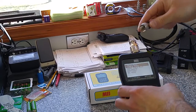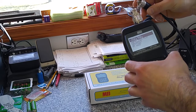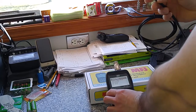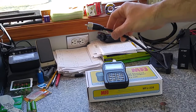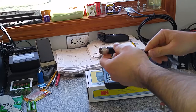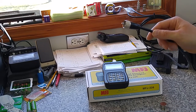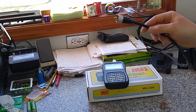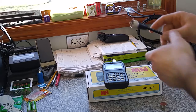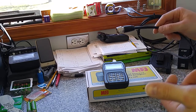Let's see what this thing can do. We got this hooked up right now to a Diamond X300A — it's UHF to UHF, SO-239s on both ends of this cable. I plan on actually replacing this cable all the way out to the little tower that I got. This stuff right here is Radio Shack RG-8X, and then all I was able to get a couple years ago was some RG-58 coax. This stuff is definitely old. The loss on it, especially once it leaves the 8X — which is only right outside the window — it goes into that RG-58. So you're going to have a lot of loss there.